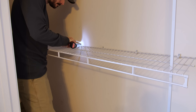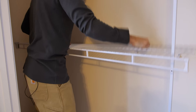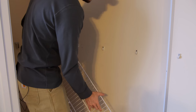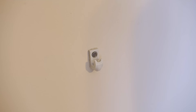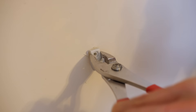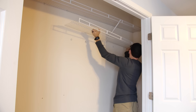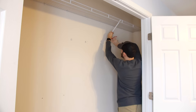Remove any clips that are screwed into the stud, and then you should just be left with the open J-style clips along the back. Pop the wire shelving out of these clips with a few quick pulls or with a mallet. The J-clips are a little trickier since you can't just grab the nail head, so use a putty knife or a screwdriver to pry the nail out of the recess first. Then grab the nail and remove the wall anchors just like before. This method works really well and just takes a little patching and sanding to get the wall prepped afterwards.